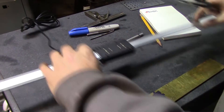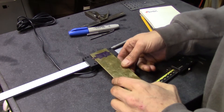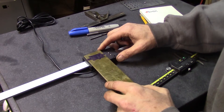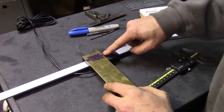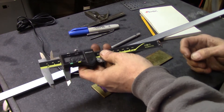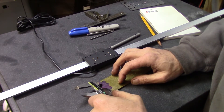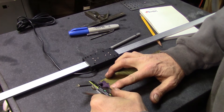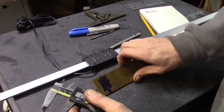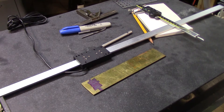I put a little bit of bluing on my piece of stock and laid it out so it's pretty much even with the back edge of the reader. I got my caliper set for 20mm — I don't usually like scribing with my Mitutoyo but it's just brass so I won't worry about it. I'm going to gently score a couple of lines, then grab my spring-loaded center punch and punch those lines, then go to the drill press and drill through and try to counter-bore.